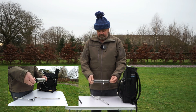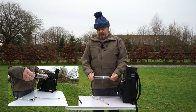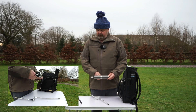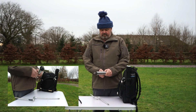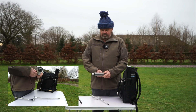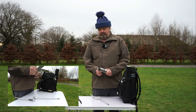I haven't had this long, but it's worked pretty well in all the different configurations I've described — on the car, in the ground, or on a tripod. It is slightly more fiddly to tune correctly with the antenna analyzer to get it into the right place, but in the end you can get it there. You can get it down below 1.5:1 SWR and it seems to work fine.